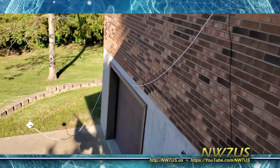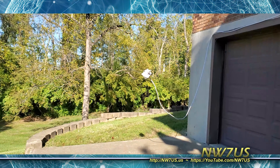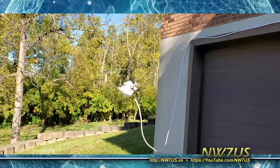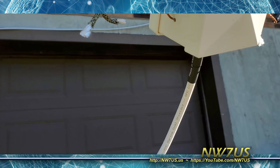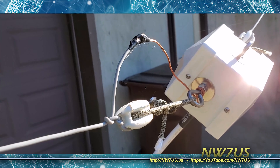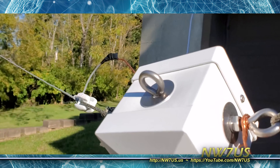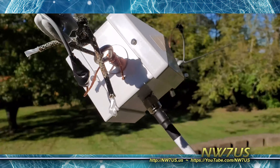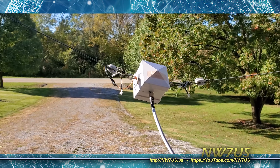It's fed with 50 ohm coax temporarily being run. Taking a closer look at the antenna, that's the feed line going into a balun — a balanced-to-unbalanced transformer. It's a current balun. I'm going to change this to a one-to-one current balun.